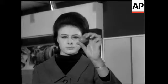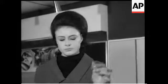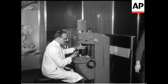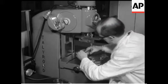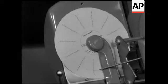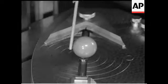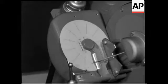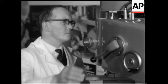How round is round, and does it matter? You'd think a billiard ball was perfectly spherical — it looks and feels like it. But now measure its surface with a new instrument developed by Rank Taylor Hobson, and a surprising picture emerges. The Talyrond works with an extremely finely balanced stylus which delicately moves all over the face of the object being examined. It registers its findings on a graph, and we see that the surface of the billiard ball has mountains and valleys, though they measure a little more than a millionth of an inch.